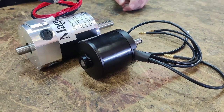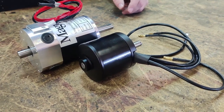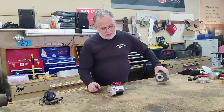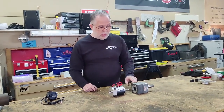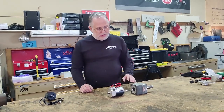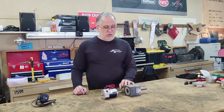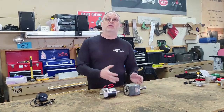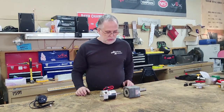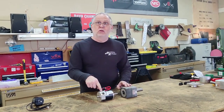We're going to do this for RoboGames for Mortician — I'm going to play around with some brushless options, and this is part of that journey. I've been using this motor with the Wyochi gearbox. This particular one is a 16-to-1 reduction, which turns out to be the right reduction to get a good drive speed. The Wyochi makes great products — strong, very lightweight, with large mounting arrangements, so they don't break. It's a solid product.